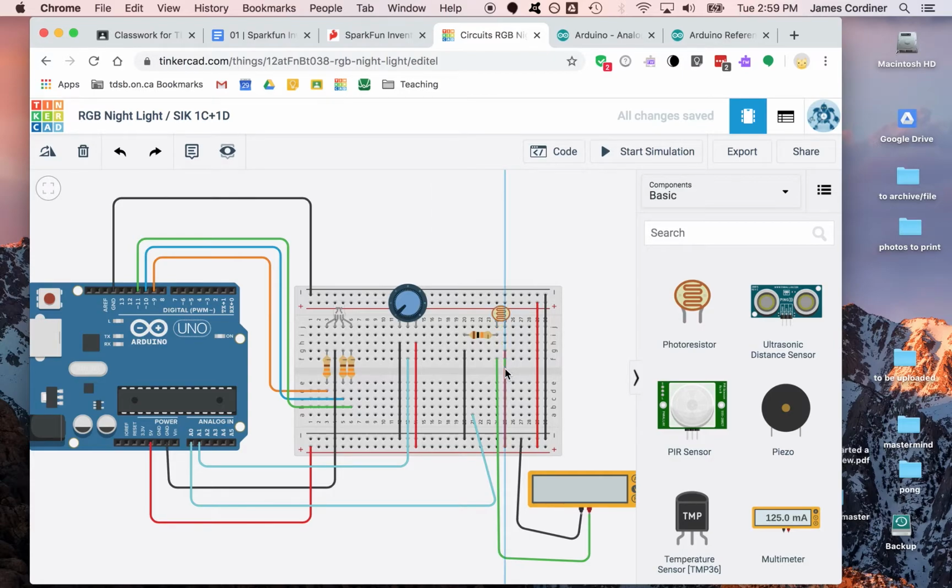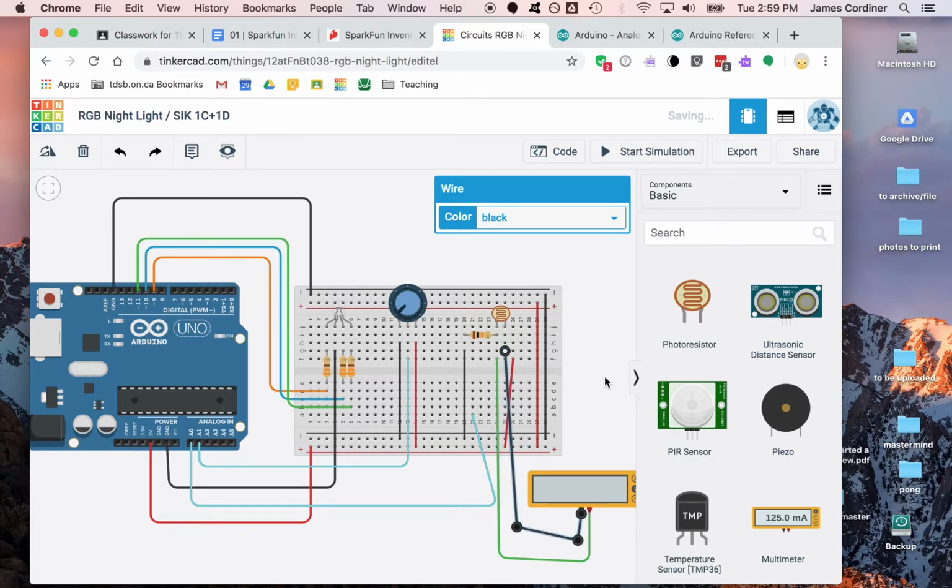Let's just disconnect it and do one other thing. I know that this is really not what the activity is asking you to do, but I think this will help with the understanding of what's going on. So I've disconnected the resistor, okay? This side is connected to the meter, and this side is connected to the meter, and this is not connected to 5 volts or the Arduino anymore. And you know what, I'll just move the resistor too while we're at it. So this thing is just fully disconnected. Let's read it in terms of resistance.